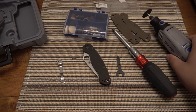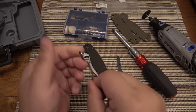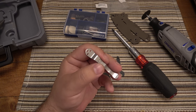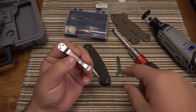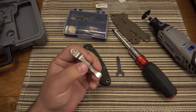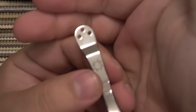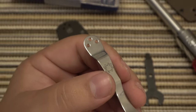The danger of doing this is cutting too far. If you cut too far, you're going to cut all the way through the screw and then into your pocket clip. In this particular case, I want to give myself a little credit — I wasn't just lucky, I was watching how far I was going. But there's a little bit of luck involved to get it deep enough to create shoulders for the screwdriver tip to grab, without going so deep you're actually cutting into the pocket clip. As you can see, the pocket clip is still good to go — so no harm there.